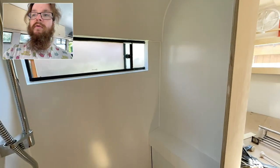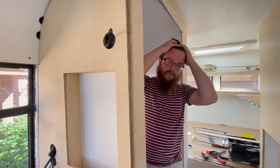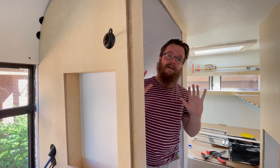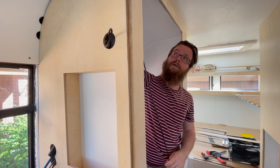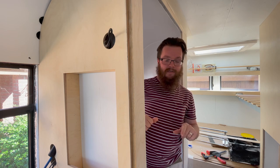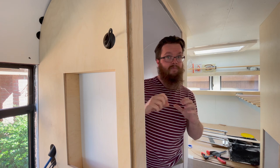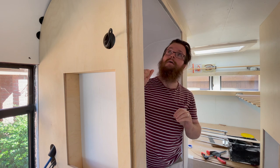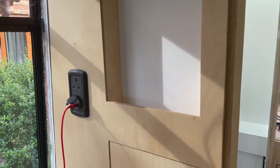I've got a bit of towel storage to install and a few other finishing touches, then we're desperate to get away in the van again and actually use it for some travel — which will be a novel idea. This cable here is going to feed our lights and I've opted for IP65 LED strip light. I'm actually going to put it in an IP65 profile trim because it seals it all off — so not only is the LED strip waterproof, so is the profile it's going in. Because this is 12-volt, we'll be fine in here. Once it was installed I added the light switch, and this was the result.